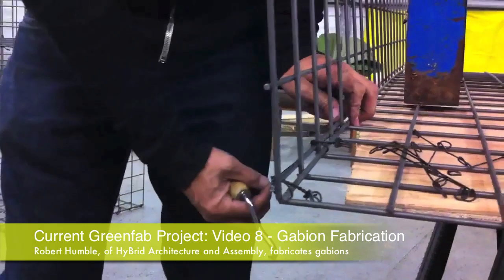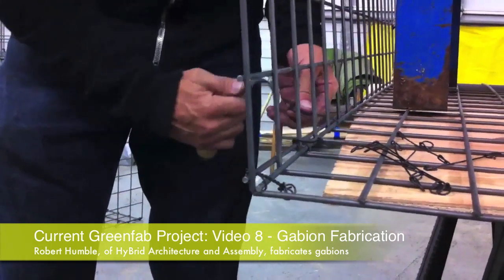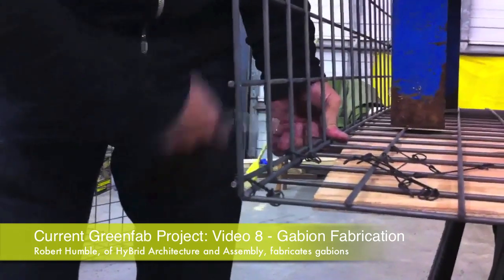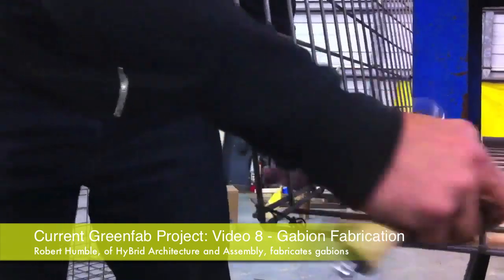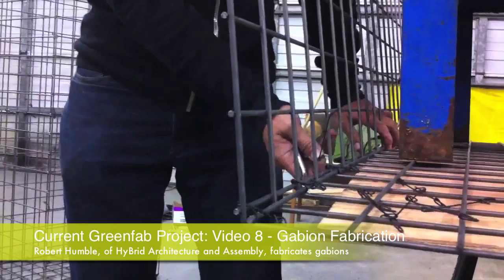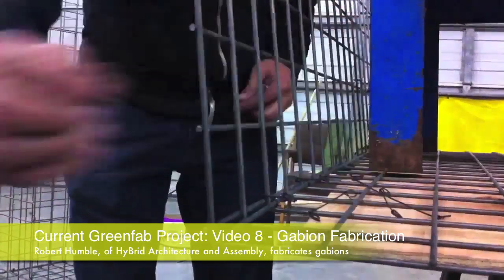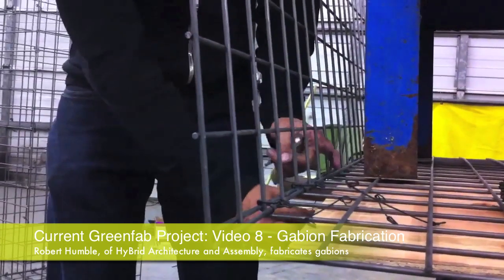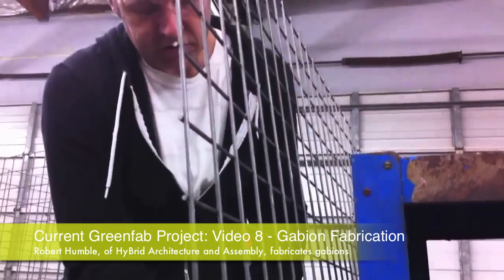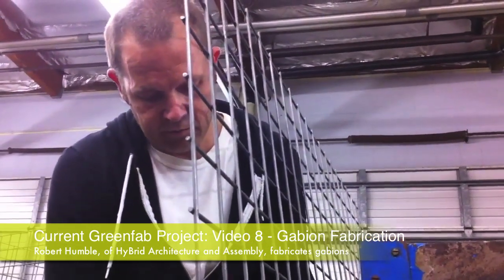This is kind of a belt-and-suspenders approach — we're actually going to go and spot weld these cages together too. The primary concern is that 30 years down the road, this thin gauge tie wire rusts out. It's essentially intended to be under concrete, not necessarily exposed to the weather. That's the primary reason we're doing the welding in addition to the ties, so that in 30 years the cages don't start to fail when the ties break.